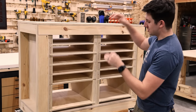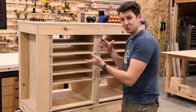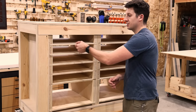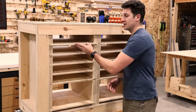We've got all of our drawer bottoms cut out. Now, before we go ahead and build the rest of the drawer, it's good practice to test fit these like I am doing right now. There's nothing worse than building your whole drawer, going to put it in, and it doesn't fit. Before you assemble these drawers, another good practice is to sand both the top and bottom surfaces of these drawers. That way, they'll just slide in here, all the better.